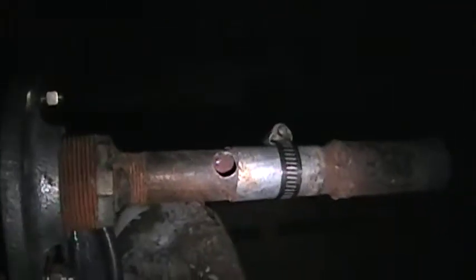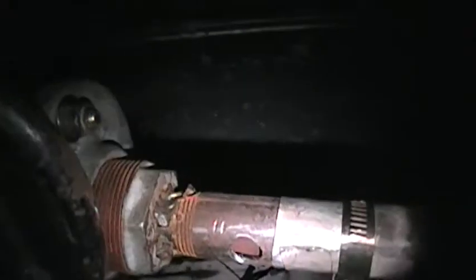There, we just lost it. So we're going to choke back a little bit more, but here you can see the top vent, or I guess that would be the top mixture hole, and then underneath is the second mixture hole. So sliding this forward, essentially we're going to close off one, and then if we continue going backwards, we're going to close off that second hole right there. We're going to go ahead and fire it up halfway again.